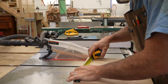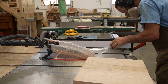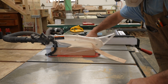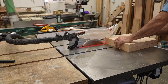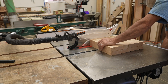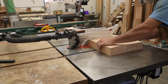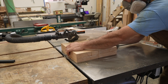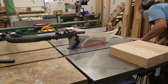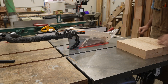I base off the center glue lines so they're exactly in the middle of the workpiece — I'll do one cut, nudge it a little bit over until it's spot on six inches in the middle for a 12-inch wide piece, and just sneak up on it. After using the rip fence, I go back and use the crosscut miter gauge to make an edge that's perfectly perpendicular. It's probably not 100% necessary, and if you can't do the reach on your table saw just use the rip fence — it might not be a perfect square, but that won't really matter for a CNC project like this.